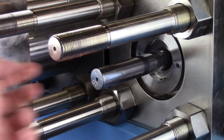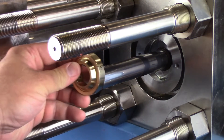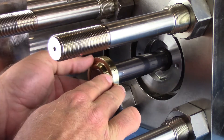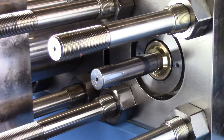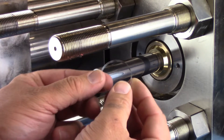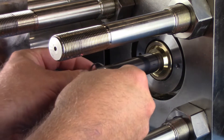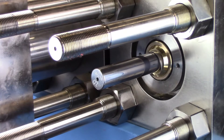Slide the coned mini disc onto the plunger until it captures the tapered centering ring. Install a new backup hoop and high pressure seal onto the plunger, noting the orientation of the high pressure seal and the backup hoop taper. Ensure the backup hoop is seated on the high pressure seal.